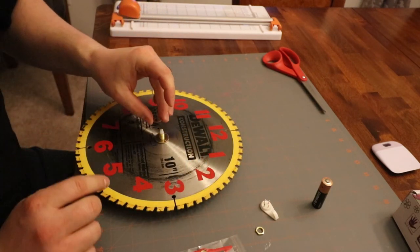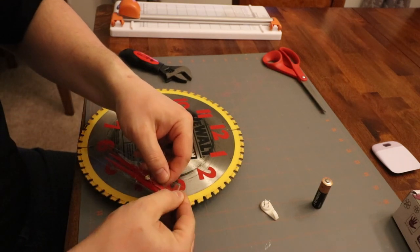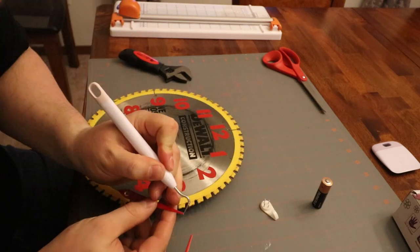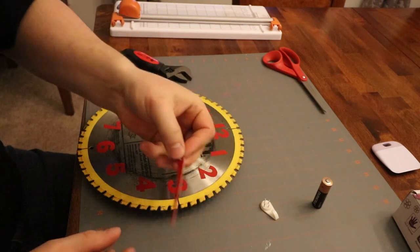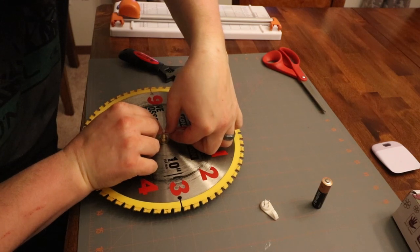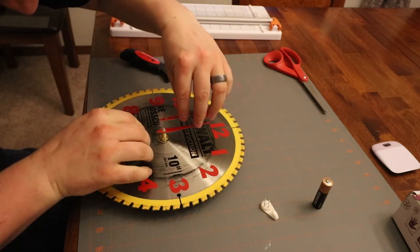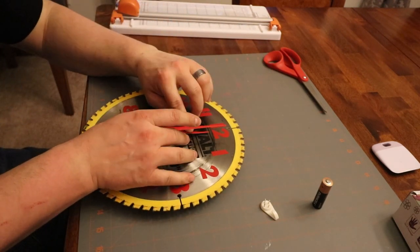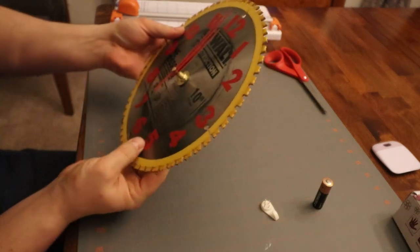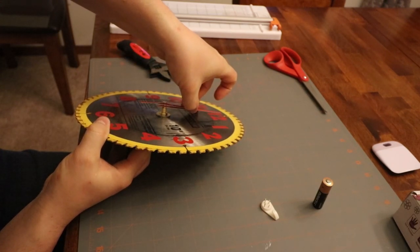Making sure we are aligned at the 12 o'clock position — which we are. I'm going to use this extra washer, then the bronze or brass washer, and the nut. Now that we have that assembled, we're going to assemble the clock hands. In my case we're doing the red ones — they come with a protective film which we're going to remove very carefully. The hour hand is the first one that goes on and we put it at the 12 o'clock position, carefully pushing down on the center until it's flush. Then we install the minute hand the same way, and then the second hand. We want to make absolutely certain the hands are not going to interfere with each other — they should be ever so slightly bent towards the clock face and away from each other so they don't interfere during rotation.